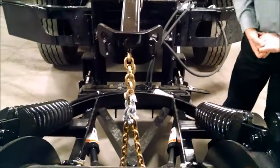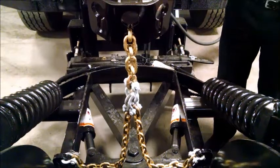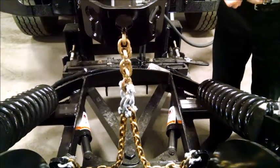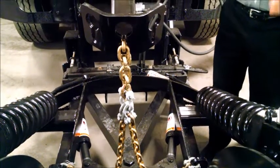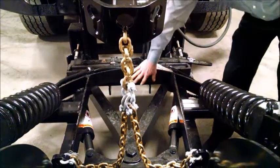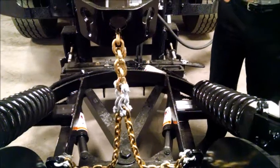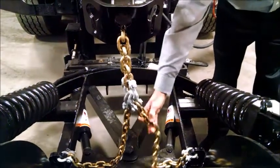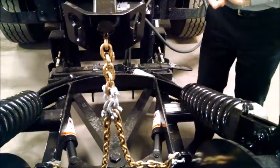In the previous example with the two individual chain segments, one chain can be excessively loaded compared to the other when you angle to one side. As the plow wants to oscillate to level lift, you may bottom against the swivel stops located in your swivel plate. The plow could load excessively, putting almost all of its weight onto one segment or the other, depending on which way you angle it.